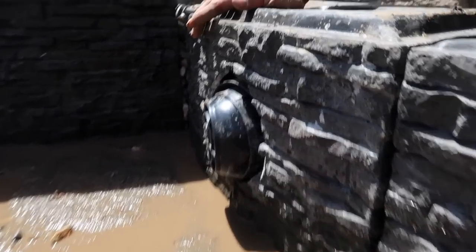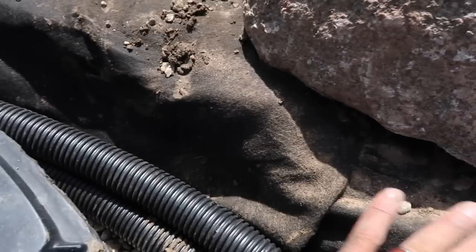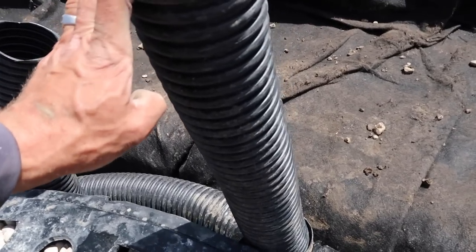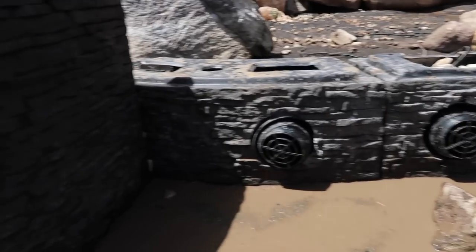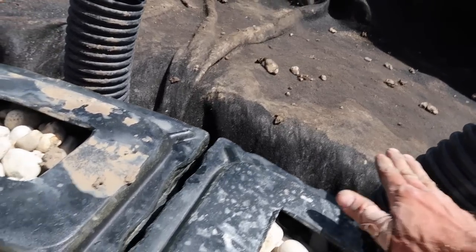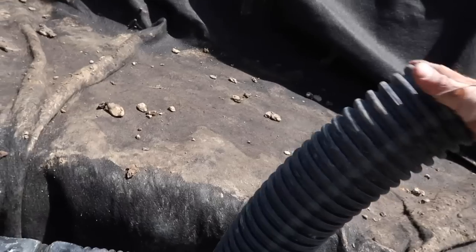has now been installed. These two lines run this way, back through this trench, and then we're gonna, again, fill all this with gravel. Here's those suction intakes. So we have two on each line feeding each one of the power heads. So that's what they look like. Look how nicely those walls all kind of fit in with each other. We will end up putting like a perforated drain cap over all these. We'll flush cut them. Once we finish elevation up here, we'll cut them, and then we'll put a drain cap so that everything can empty down in here.